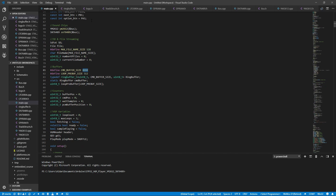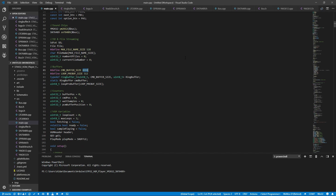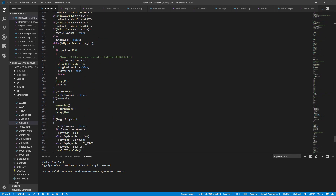A couple of other fixes: I changed the way that the chips are written to. I've written a nice bus class, and even though this is still a little bit on the ugly side, it's a lot better than a Boolean check on every single bit. I'm using the registers a little more properly now. The bus write speed has been improved from around 65.1kHz to 330+ kHz. For PCM samples, they're still stored in that little external RAM — I only have about 20k on this microcontroller — but I've prefetched the next byte in every PCM sample, caching it in local RAM from the SPI RAM before the next sample plays, so that should speed everything up.